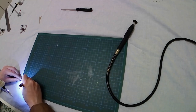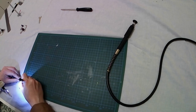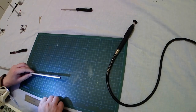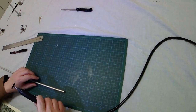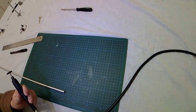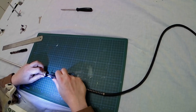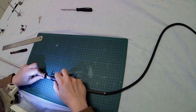Let's start by marking all around the perimeter of the pipe at 8 centimeters. Here we go — it's just a long process but nothing very complicated. Once I have marked all around the perimeter, I'm checking it because I don't rely on myself. So let's take the Dremel, set it to full speed, and start cutting all around the perimeter — firstly very gently, because otherwise you risk cutting over or under the length and the cutting tool will slip over the right position.